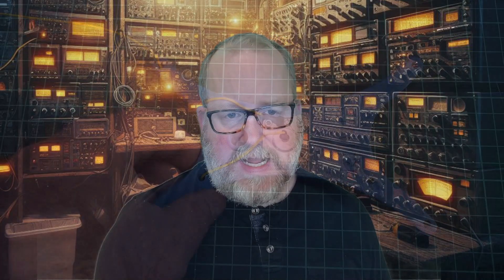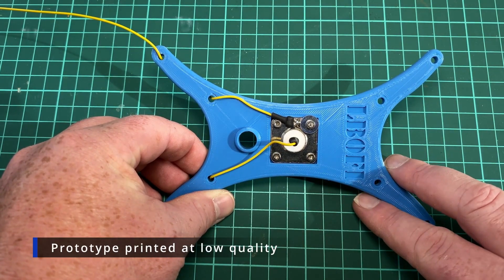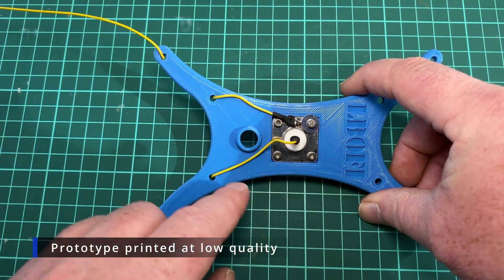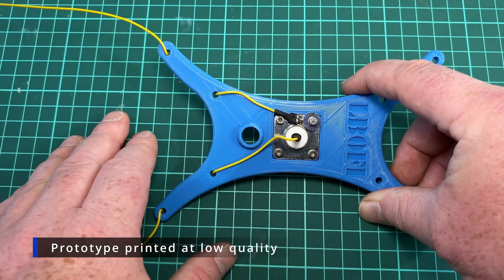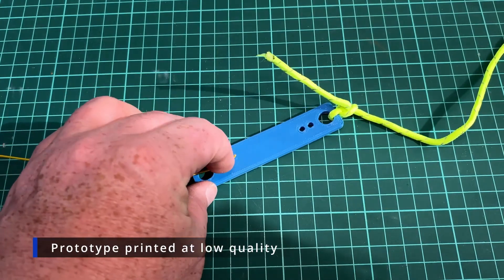The middle of my recommendations — neither worst nor best of my top five list — is the well-known dipole antenna. It consists of a feed point with two equal-length quarter-wave elements. A dipole is a great performer as long as you get it high enough — about a half-wave or higher — but even lower, a dipole will perform. It's probably the easiest antenna you can build: two pieces of wire of the same quarter-wave length, some way of making a feed point, and that's it. You can string it up horizontally or as an inverted V or a flat top. It is a monoband antenna though, so beware of that.